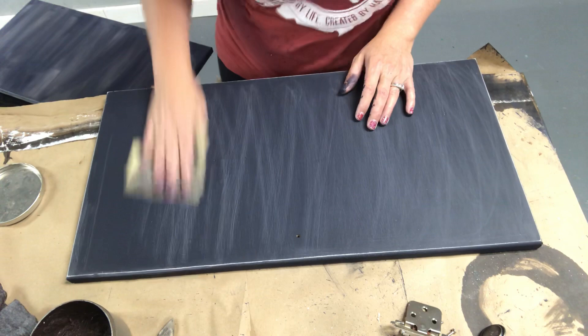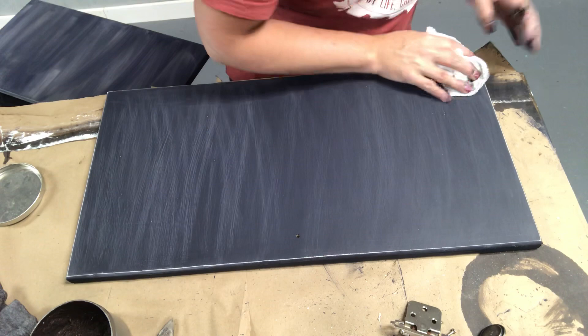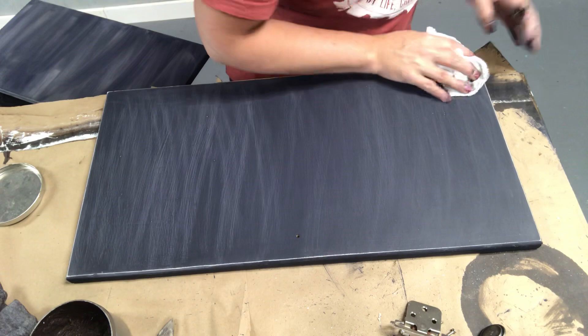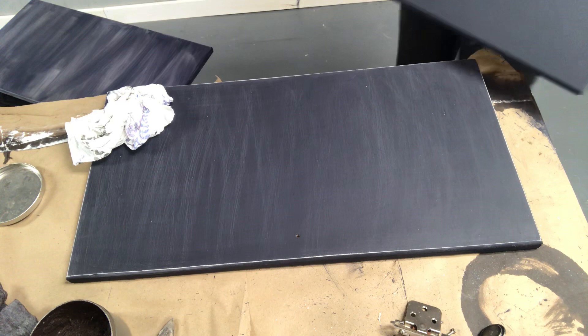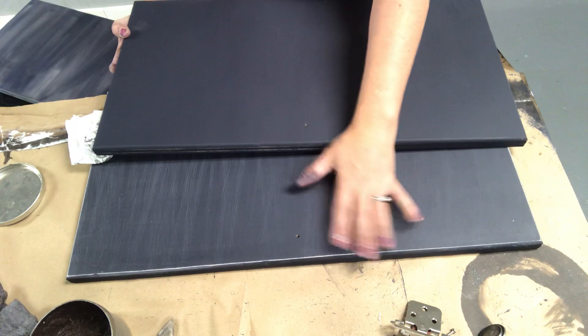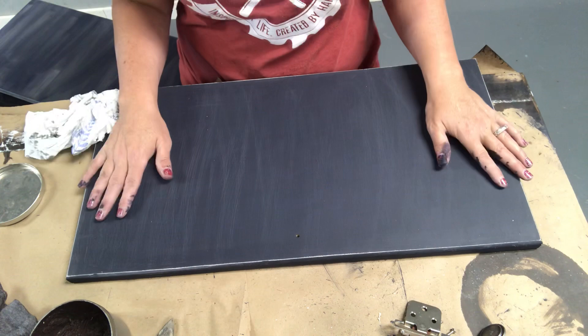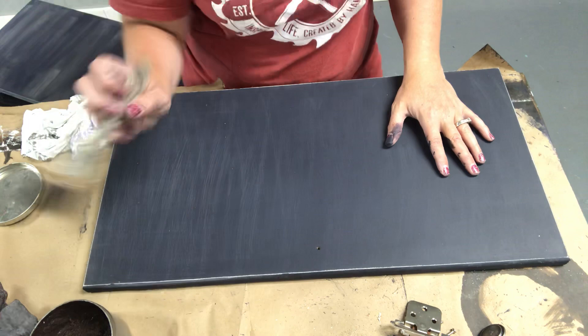Then I'll put my wax on, put my hardware on, and I'm ready to hang — it's really that simple. I'll come back and give this a good dusting to remove dust particles and then apply whatever finish I want. Now a disclaimer: you could leave the piece exactly as painted without any distressing, waxing, or sanding. If you just like solid navy, you can totally do that. I'm going for a rustic look so I sanded and distressed the edges. The great thing about Dixie Belle paint is you don't have to put any finish on it. Once it hardens in 30 days, it's hard as a rock — it should not chip, it should not peel.